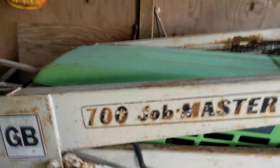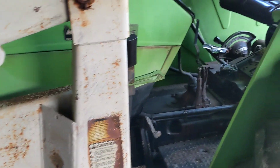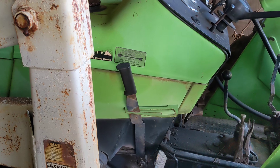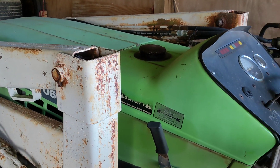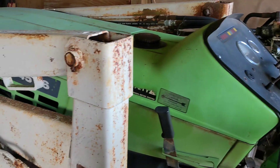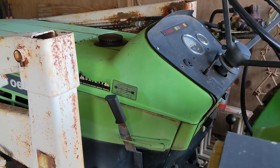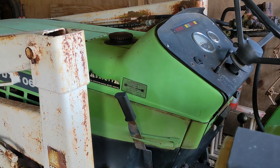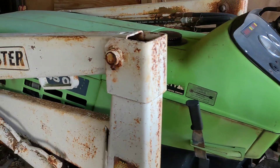As for the good things about this tractor — it's pretty straightforward. It's air cooled, which is nice. There's a lot less that can go wrong. It's powered by one belt up front, so you do have to keep an eye on that and make sure your fins are clean, but it makes that very easy — just some snap covers you can pull off. I'll put a link below to the playlist where I have videos covering maintenance.